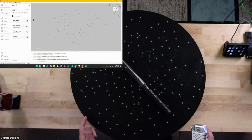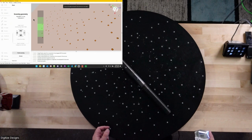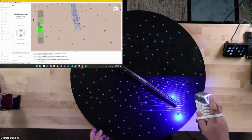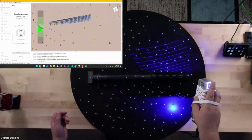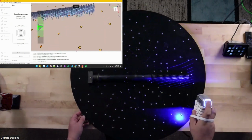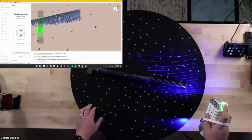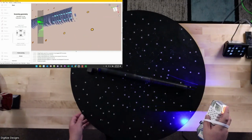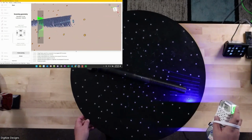In this scan, we've got base removal on, and that'll automatically set that up. It's going to be really quick here. I did do a little higher resolution for this one, so it's going to scan seemingly a little slower, but it's still scanning very quickly, it's just having to grab so many points because those points are that much closer together. If you cut the resolution in half, you need 4 times the points to scan the same area, since there's that length to area relationship. There's a square in that formula.